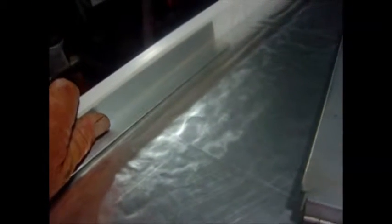Here is the completed assembly — the sides onto the frame for the basin. I've got everything screwed in, fastened, and cleaned up. The next process will be putting some reinforcement tape along this edge right here and coating that with silicone, which will make the seal. There will be more silicone going on top of that to bed the aluminum angle. As the metal angle is placed in there, there will be silicone under it and silicone behind it — it will be raised up a little bit with the glass. That's the next process — putting the aluminum angle on with silicone.